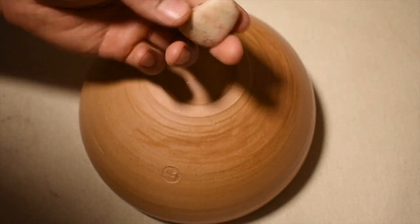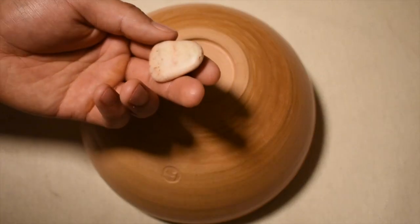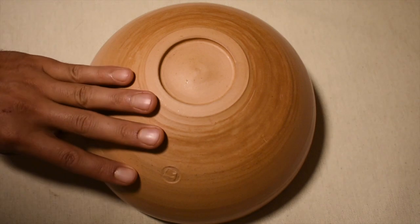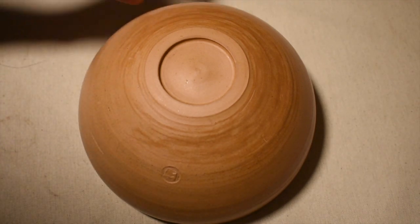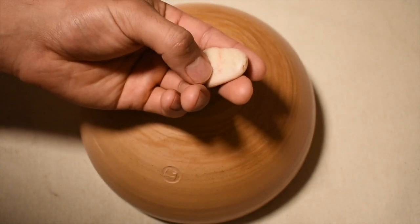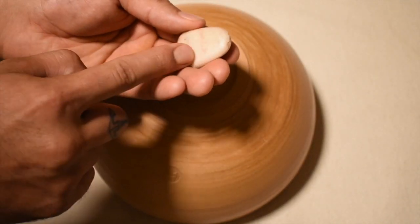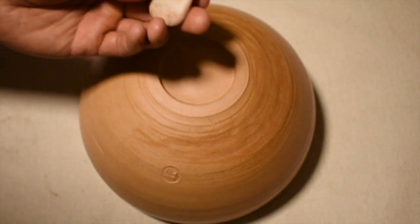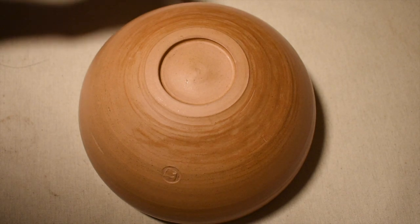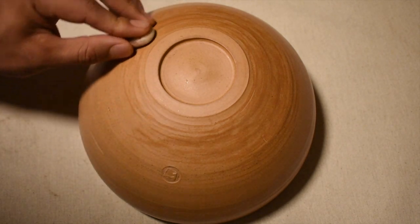On the hardness scale, if you could find a topaz with a mirror finish you would most likely get a mirror finish result on your ceramics, because it's more compact and higher hardness — so it's not going to have as many scratches or divots in your stone as you're doing this. Topaz is rated 8, so you could almost get a mirror-like finish if you found the right stone.